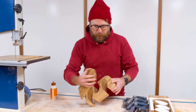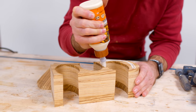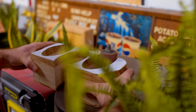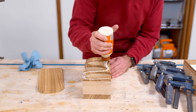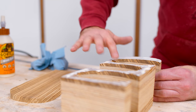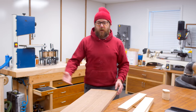Now it is time to glue the back back on there. Even though our table wasn't set to 90 degrees, it will all work out just fine. We lightly sanded the inside — not much, just wanted to remove some of the rough teeth marks, but I didn't want to change the shape or expand the hole. Just light sanding. Now we're going to glue that back back on and try to line up that curve as perfectly as possible to hide that cut line. You can never have enough clamps.